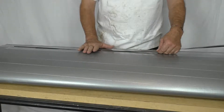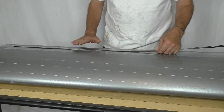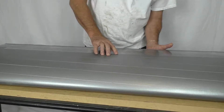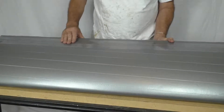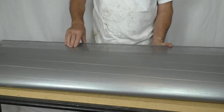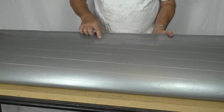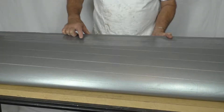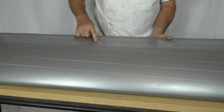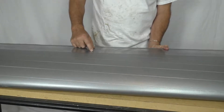it's essential that these cap strips be molded to match the curve of the airfoil. Otherwise, when the D-tube and trailing edges are bonded on, the airfoil would have a flat spot where the main spar is. So even though this surface might look flat, it actually has a curve to it that's the actual airfoil shape of the wing. This red line here represents the center line of the main spar of the wing, and nominally I would have 15 or 16 of those rods in front of the red line, same number after — so we have a symmetrical cap strip.